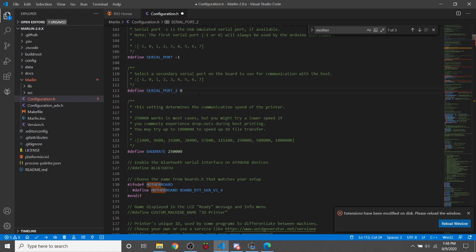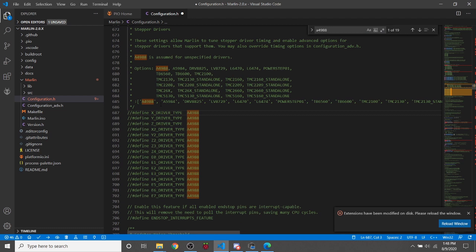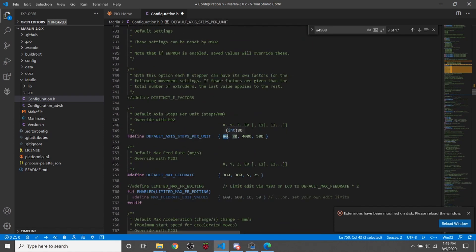Now I'm going to set up steppers. I'm going to search on A4988 and set up the X and Y so you can see them operate. I'm going to remove the comment for the X stepper and do the same for the Y. I'll be using DRV8825s, which I'll install off-camera — if you're not sure how to install these, check my tutorial linked in the description. I'm going to scroll down to the steps settings and change these to 400, which will make more sense if you watch the stepper driver tutorial.